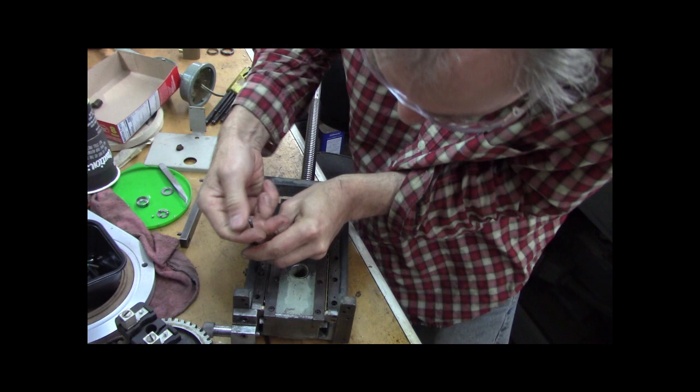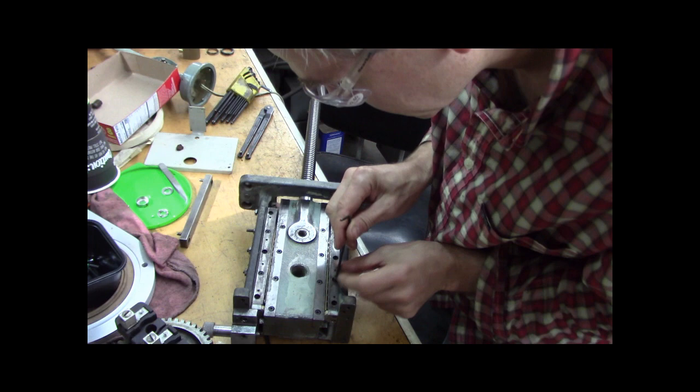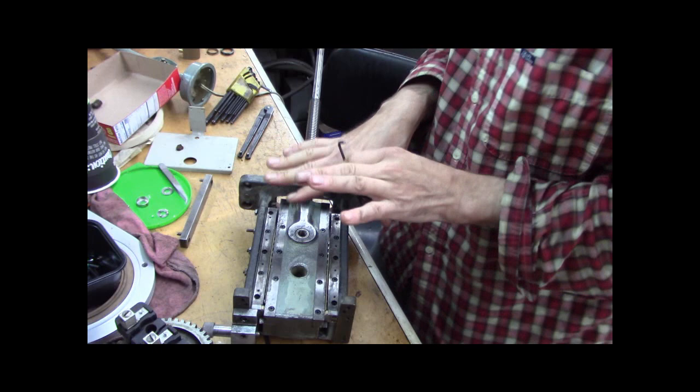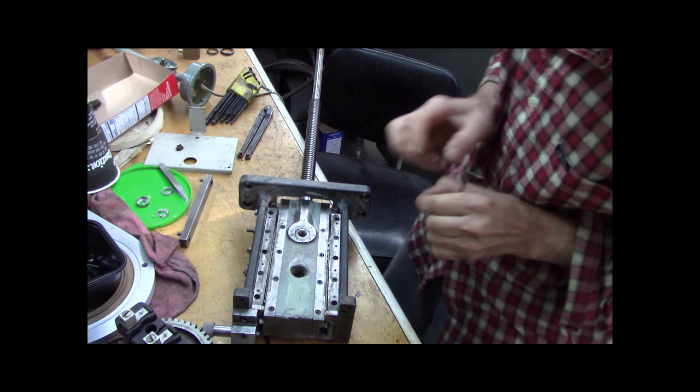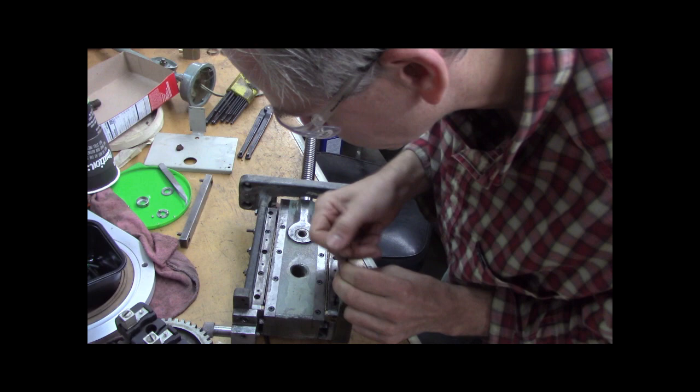Yeah, anybody with a Pratt & Whitney... Oh, so something I wanted to talk about. I don't know if I mentioned it last time, this is the ball bearing taper attachment, obviously. Pratt & Whitney on this lathe offered a non-ball bearing taper attachment. And what I think is going on here, the reason for the existence of the ball bearing taper attachment is not just solely because maybe it's more friction-free and better. They had an eccentric relieving attachment. Now what that is, it's also called a backing off attachment, used for relieving taps.